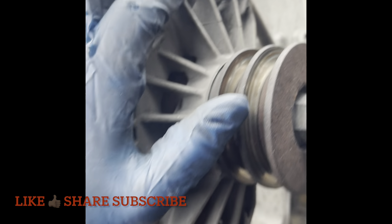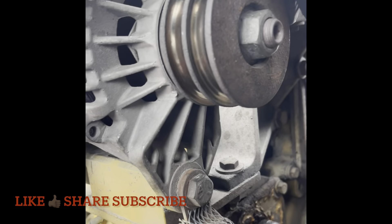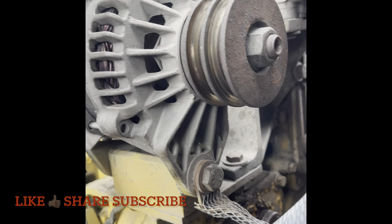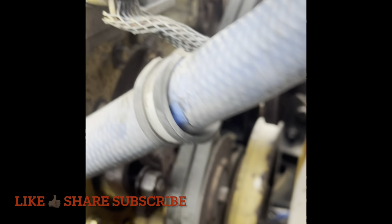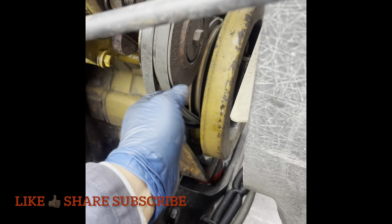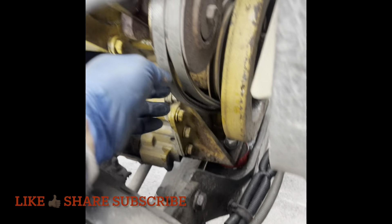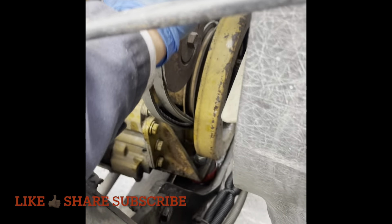You're gonna use this one to back down to get the whole alternator to go forward. Once it goes forward, back this one down. I could have just left it there but I still had to back this one down a little — WD-40. We can go ahead and get these belts off. Should have enough slack to pull down, so let's see if I can wiggle this off.